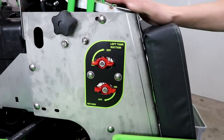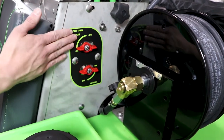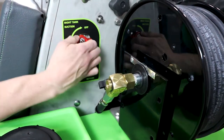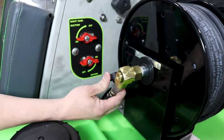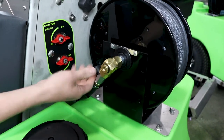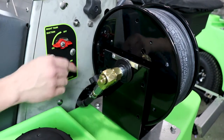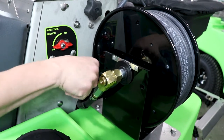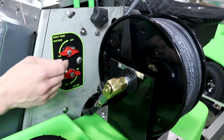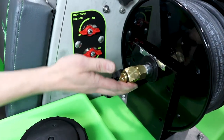Now we can move around to the right side of the machine. You'll have the same set of valves here — suction on the upper, return on the lower — and the same position rules apply. You will also have another valve on the right side: the shutoff for the hose reel. Leave this in the off position — perpendicular to the valve body — at all times unless you're using the spray gun. If it's open, that 75- to 100-foot hose is holding 40 to 50 pounds of pressure, and when you turn your boom off it'll make your nozzles drip. Always leave this off unless you're using the hose reel.